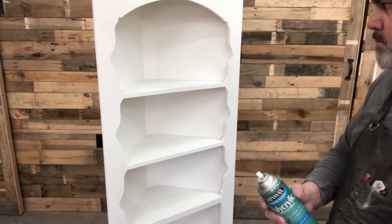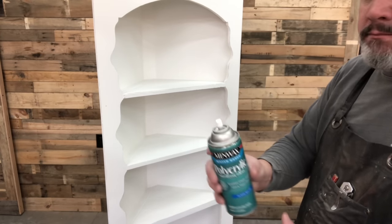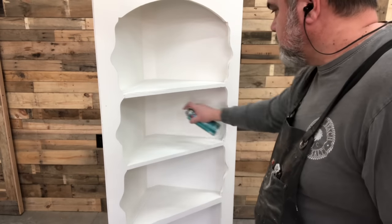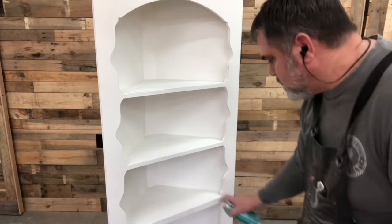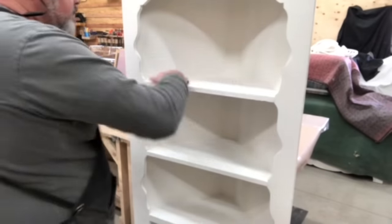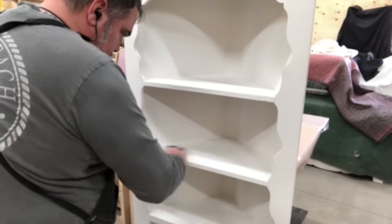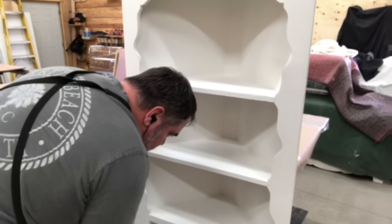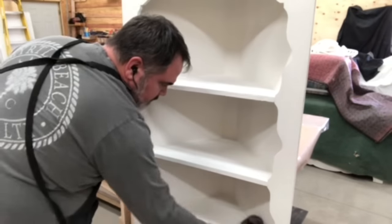He's going to be adding an extra layer of protection to this piece since it's open shelving and may be in a kitchen area. He'll go in with some polycrylic and put a nice generous coat on each one of these shelves. Then he gives it a light scuff with a sanding mitt to open up that polycrylic and take a little bit of the shine off. Even the matte polycrylic tends to be shiny, so you want to open it up before the next step. Then just take a dry cloth to remove any sanding dust left behind.